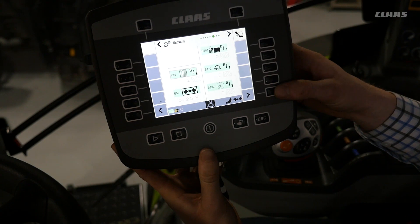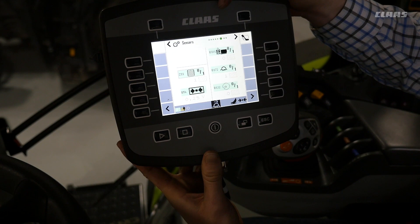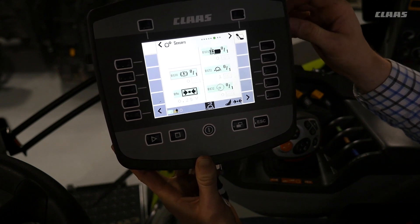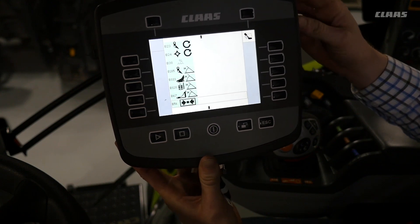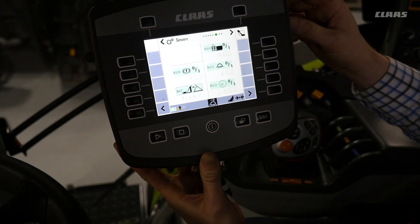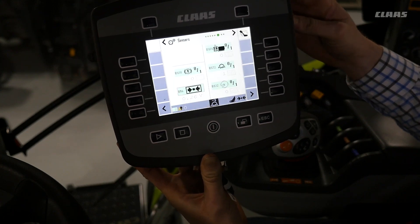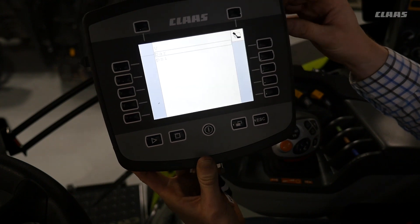You can also get to the sensors menu. Here it shows the available sensors, and you can select which ones you want displayed — a zero or one determines if that sensor is on or off. On the pressure sensor, you can see it is giving you a voltage reading. You can also select the drop floor sensor, where only voltage is applicable. Going back to the pressure sensor, you can also select the pressure reading directly.